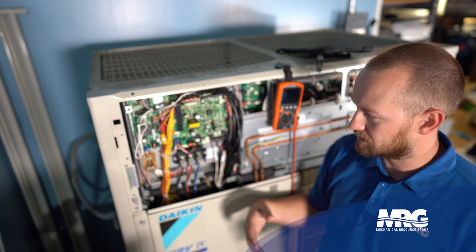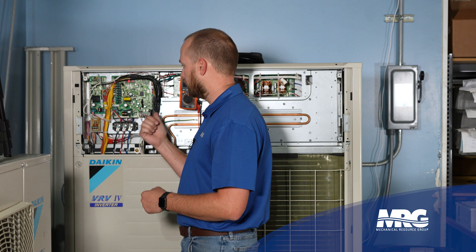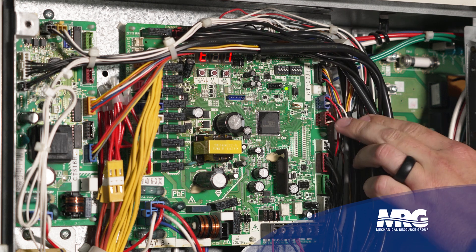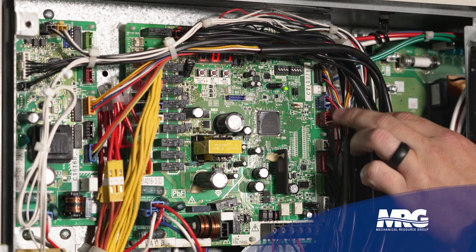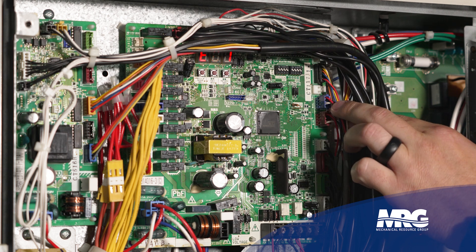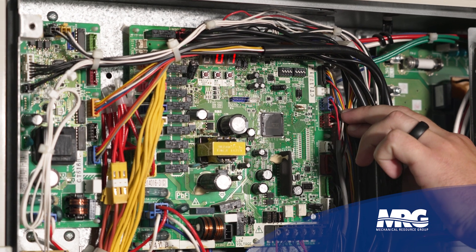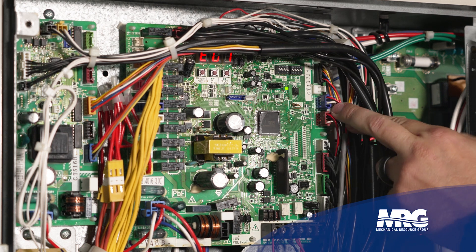This step isn't totally necessary, but if you have the opportunity to shut the system down and check all sensors at the same time, that's best practice. You can also check the pressure transducer while the system is running. In forced recovery mode, look for two small connectors — one blue and one red — side by side. Each has three wires: a red wire for 5-volt DC power supply, a black wire for ground, and a white wire for the signal back to the board.